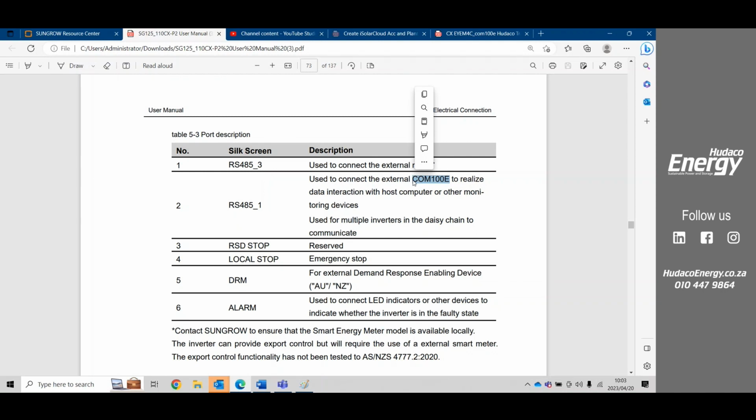Solar power also has a payback time. Its payback is normally about 3 years on average, and then you're looking at 25 years, or actually 22 years under linear warranty. The linear warranty on your solar panels is 80% of its original output at the end of year 25, which means that your solar products actually last 30, maybe 40 years. So maybe at year 30, you're only producing 70% of the original power that you had in year one, but essentially it's still adding value even at year 30. So you're looking at 22 years of free energy.